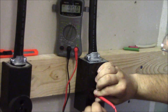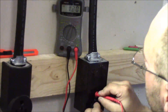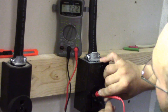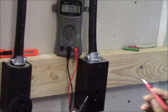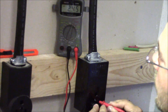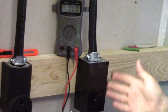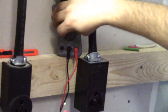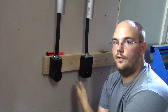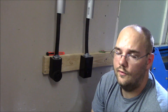Getting the probe into the plug far enough to reach the terminal — there's 122 volts there. Go to the other side: same, 122 volts. Where you get your 220 — or in this case 240 — is across the two hot conductors, and they're reading 244 to 245 volts. So that is a correctly wired 220/240 volt receptacle. We've got our plug wired in and it'll give us the correct line voltage we need for 220 to 240 volt equipment.